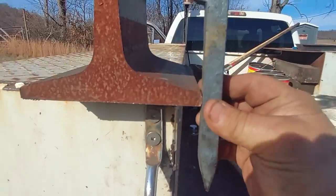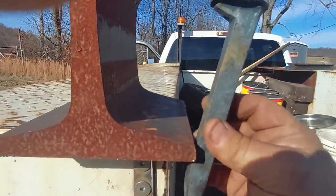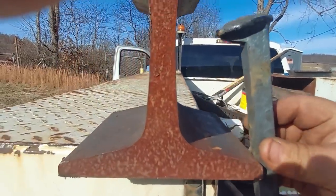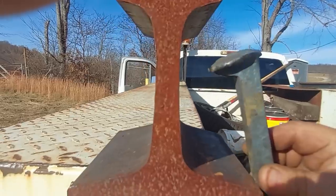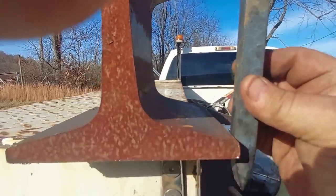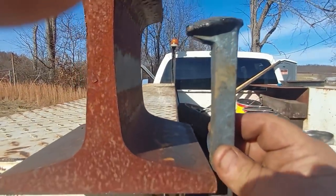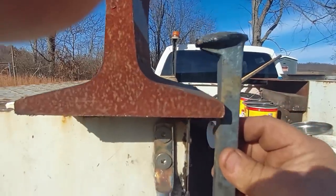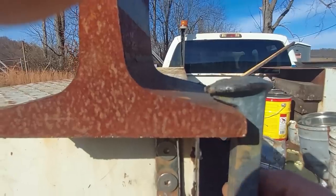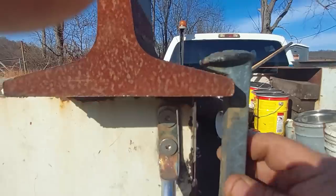When you set a spike, you set it straight. You don't want it leaning one way or the other — if you set a spike crooked you're going to get yelled at, because that's not right. If you set it leaning toward the railhead you're not going to be able to drive it down because of the railhead being in the way. So when you're a gandy, you set the spike straight up and down, or you get yelled at. They're driven down straight, and you can see how they fit right up against the base of the rail.